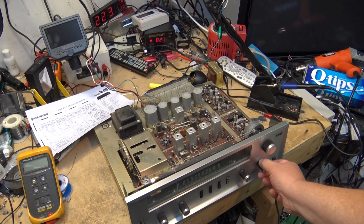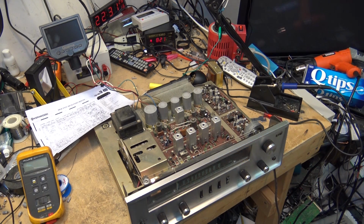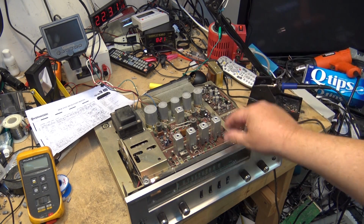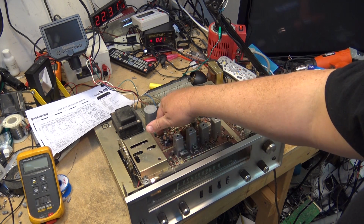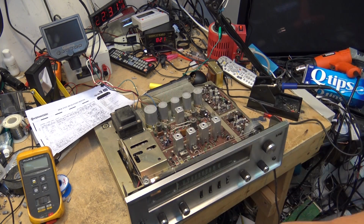So we've got to shut this off for a bit here, because I don't really want to have any trouble. We'll wait for the next song, because I put a few songs on here. This bloody thing is working. It's just the stupid light isn't coming on. So somewhere in the stereo detection circuit in this area of the board that turns that light on, something is not triggering it. But that thing's receiving stereo, and I've been pulling my hair out on this for hours, trying to figure out why the light is not coming on. I was assuming it's not receiving stereo, but it actually is.